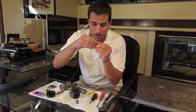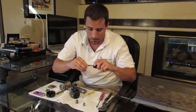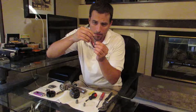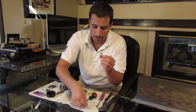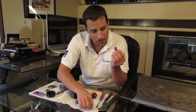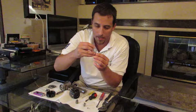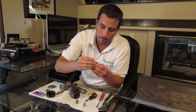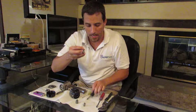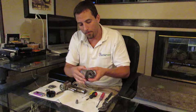With the check valve assembly, here's a screen that sits on top of that. You can unscrew this little tiny screw on top of the check valve — that sits inside a spring. Here's the little spring, and there's a tiny ball in there. That little ball just sits in the bottom of the check valve, and then there are these two o-rings. Drop the ball back in, set the spring back in, and screw the little screw back in — you want that screw to be about flush with the top of the check valve. Lay the screen back on and pop the check valve right back in.